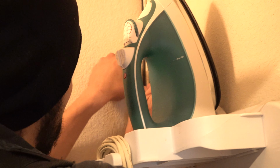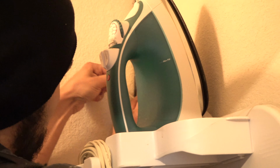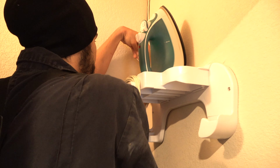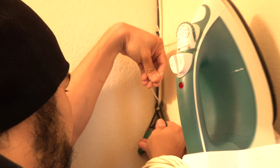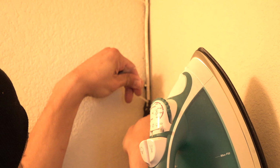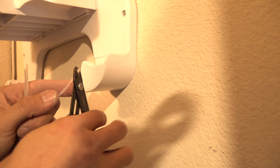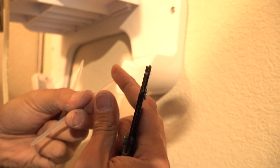So we're just gonna secure it to the wire that's already nailed into the wall with tiny little zip ties. One thing with these zip ties, never cut them at an angle, because the next guy that comes in here, it's like a razor blade just waiting to cut somebody. And this goes for every zip tie. I've had them in automotive where they cut them like this instead of flush. Oh, so like pointy? Yeah. So you get in there, it's scraped.